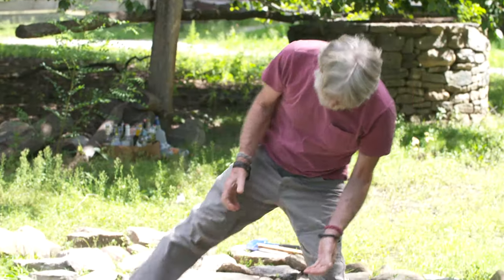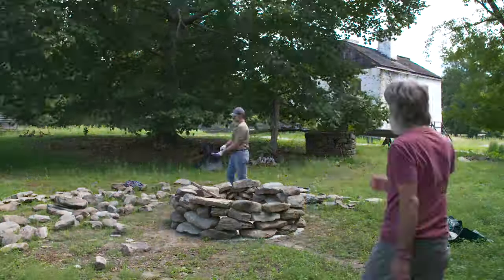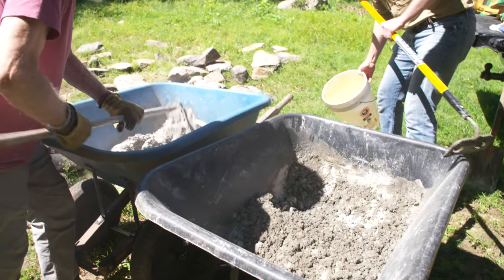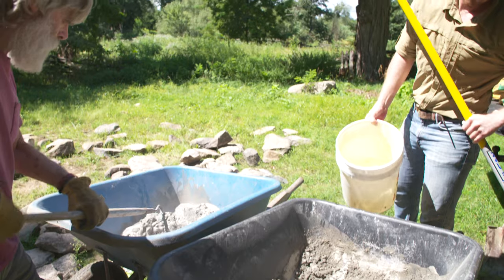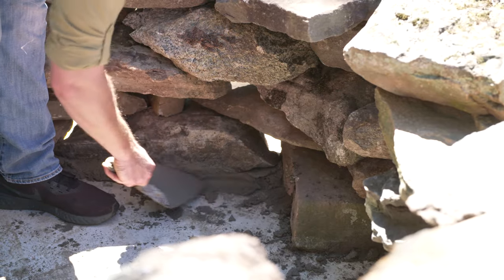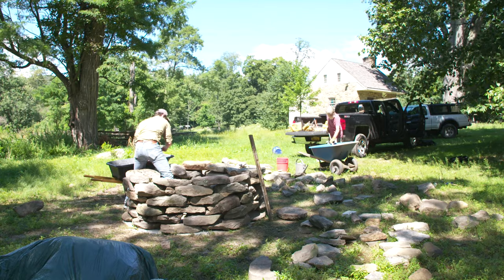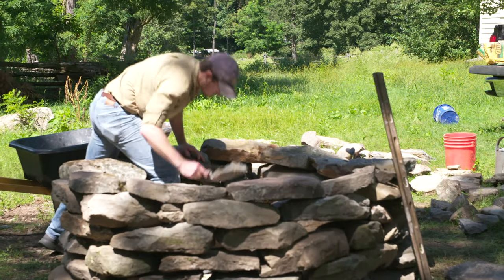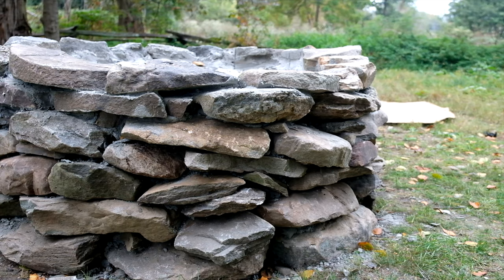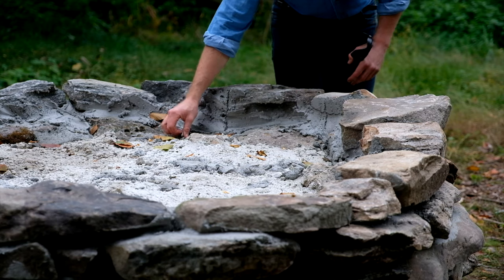Once we had a freestanding structure, we were able to come in behind the actual wall itself and add some modern materials like masonry mortar to really shore it up and make sure that it doesn't tip over over time or that any stone pieces don't fall out. After we were pretty sure it's not going anywhere, we took our extra Fieldstone and piled it into the core of the stone wall we had built, filled up our space, and then leveled the surface using a little more masonry mortar. Now we have a nice basin — basically a bird bath, if you will — that we can pour insulation material into.